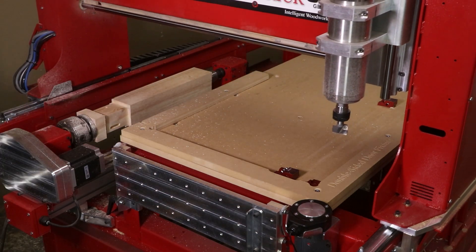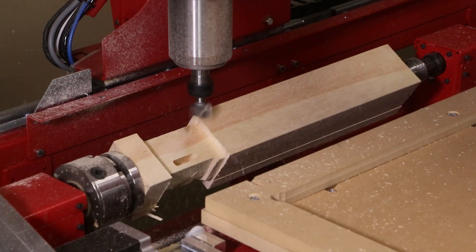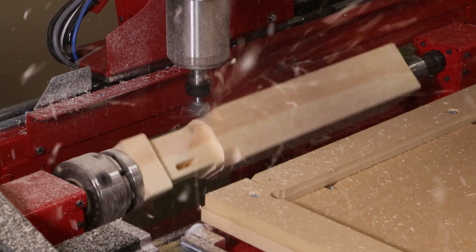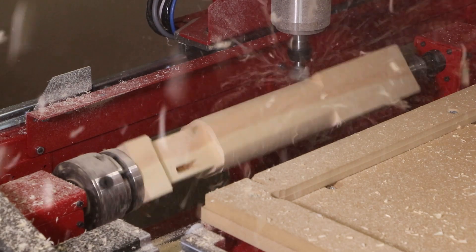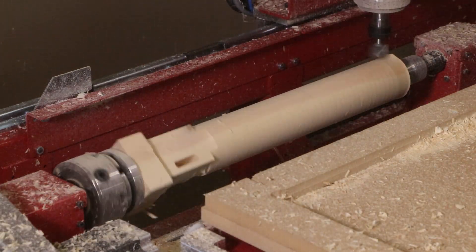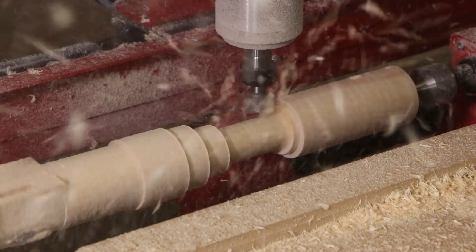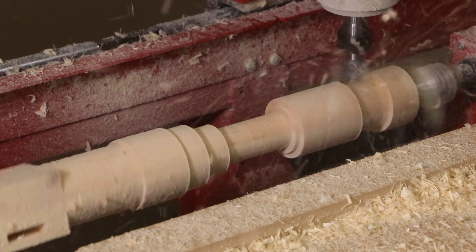After the indexed multi-sided section, and after all of the sections are complete, we can proceed to the turning sections of the spindle. The surfacing cutter is a great example of using the power of the shape of a cutter — not only returning stock round, but also quickly roughing out the material to a general shape.